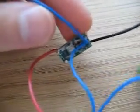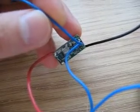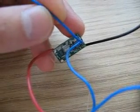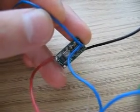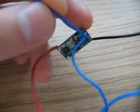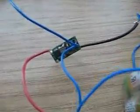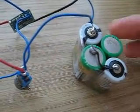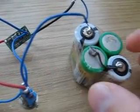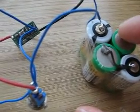I've got the driver here called a Microdrive V3. It's a very popular laser diode driver — I'd say it's one of the best ones to use these days. It's small enough to fit in the standard Aixiz laser module, so it's very compact and gets the job done. As a power source I've got 3 CR123 lithium batteries — you can see 4 here but one is not connected in the circuit.